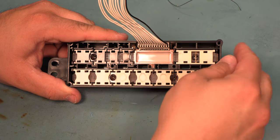Okay, the next two capacitors that we're going to replace are 39 microfarad. We'll go ahead and remove those. And again, we just heat those leads, rock the capacitor from side to side until the old component drops out. We'll clear the holes with our vacuum solder removal tool.